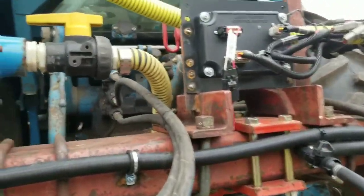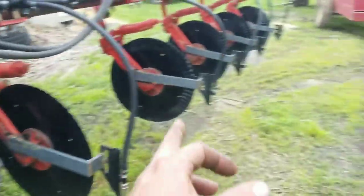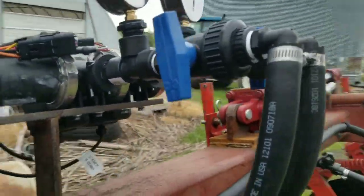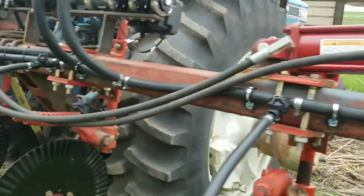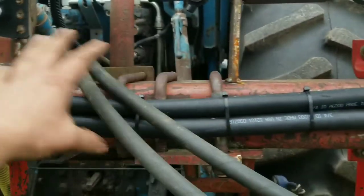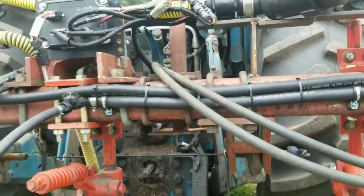Pump is mounted and plumbed in. Basically, I got these five, and then these six. So you got six for the right side and five for the left side. I have shutoffs and gauges mounted. I'm waiting on a dealership for my hoses, because I'll bring my hoses along the frame here and then bring a little plate up and weld a couple of T's on it. It'll be somewhere in here. When I get to that point, I'll weld a couple T's on and then run it to the SCV on the tractor.